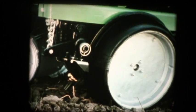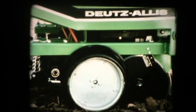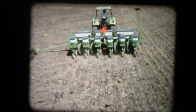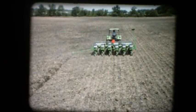The second advantage is provided by the 18-inch closing discs that make the Model 385 so special. These big discs overlap the opening discs to prevent soil from being thrown away from the seed trench. The closing discs also provide depth-controlled soil covering of the trench, which improves the accuracy of seed placement in conventional and conservation fields.